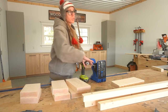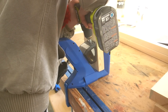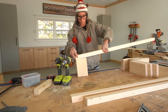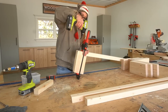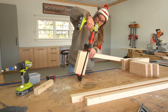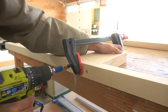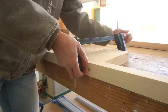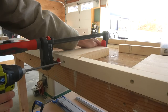For assembly, you can get as complicated as you'd like, but since this is literally a $30 spruce wood shelf for holding family pictures in my mom's foyer, I was not concerned with getting fancy here. I drilled one and a half inch pocket holes into the angled ends of the shelf slats, then began assembling. I started by securing all of the shelf slats to the back corner post first, starting at the top and working my way down. I used a scrap wood spacer block to help me evenly space the shelf slats about eight and a half inches apart.